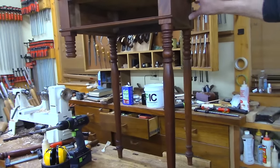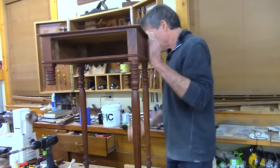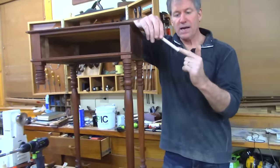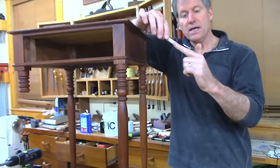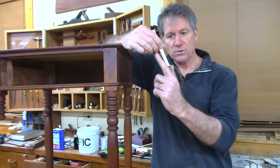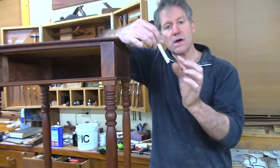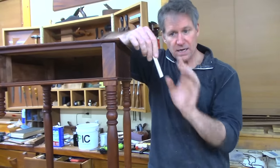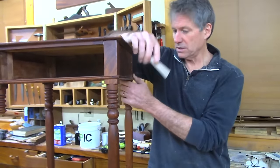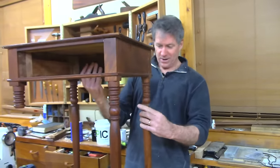That's pretty sweet. Now, if the dowel is loose into one side, like it felt a little loose into one side, I'm going to actually take a wood shaving and put a little glue on the dowel into whatever side, and you can just wrap a shaving around there and let it dry, and then you can lightly sand it, and you will have a slightly enlarged dowel for that head, all right? So there we go, I'm liking that.